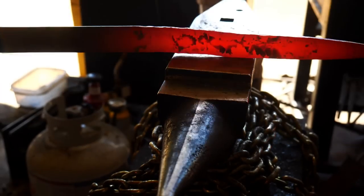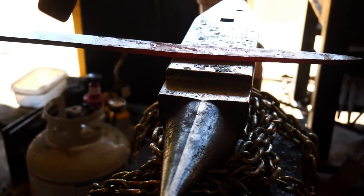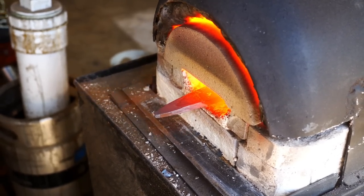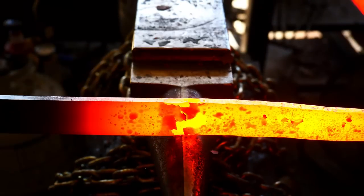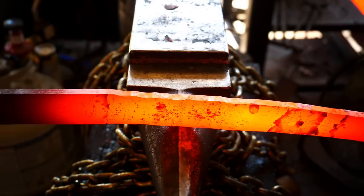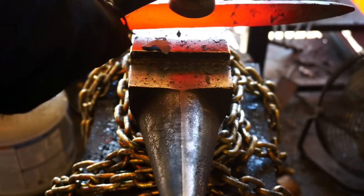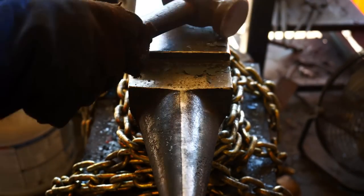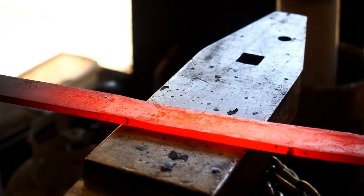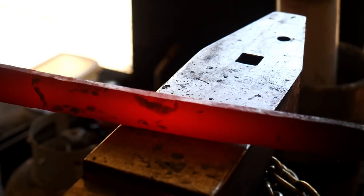All right, predictions. There's a lot of challenges here, but I have two main concerns, and they're pretty big. The first is symmetry. Will I be able to maintain uniform thickness and hammer out something that's symmetrical and then grind it? I've done a lot of grinding single edges where you grind two bevels, but this has four bevels, two edges. They just have to line up with one another from side to side, right? And the bevels themselves have to meet in a straight line down the middle of the sword on two sides. And the sword's a pretty unwieldy thing to grind.